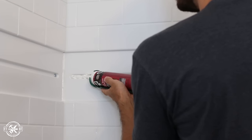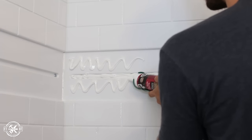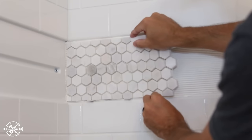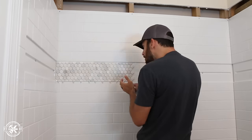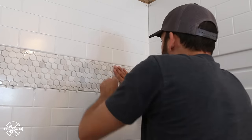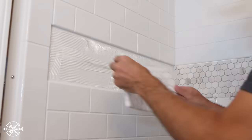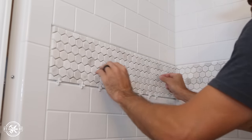The tile install is quite a bit different than normal tile install. Regular mastic won't stick to the acrylic, so again I had to use the special sealant. First I caulked the corners to make sure they were watertight, then I filled in the screw channel to seal the screws and give a flat surface for the tiles. After that, the sealant is applied just like mastic and troweled with a v-notch trowel. I pressed the mosaic strips into the adhesive and used small spacers to keep them from sliding down. My biggest piece of advice is to watch your edges on the top and bottom — there's a fine line between getting just the right amount of adhesion without too much squeeze out. I smoothed everything out best I could and let it sit for another 24 hours to cure.